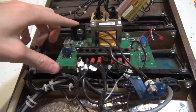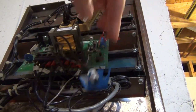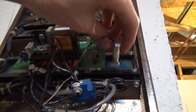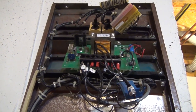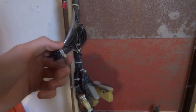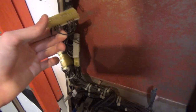This here is the circuit board for the emergency light. Over here we've got this little test button — this is what you'd use to test it, but it kind of broke off. This probably tells you if the battery's working. We've got our bulbs here — these are little 9-volt bulbs. We've got our transformer and all the hookups here. This would normally be hooked up to a battery so if the power goes out, the lights kick on. We've got huge clumps of wires that run down the side where it originally would have gone to the controller, which has been chopped off.